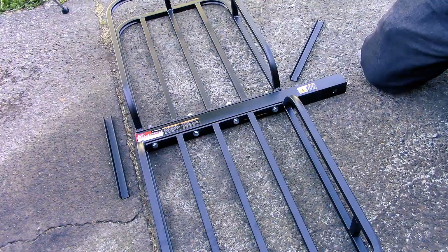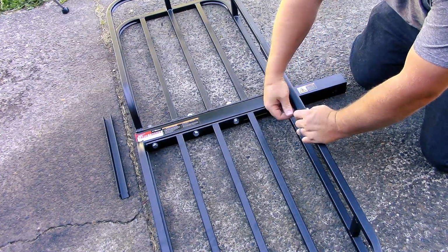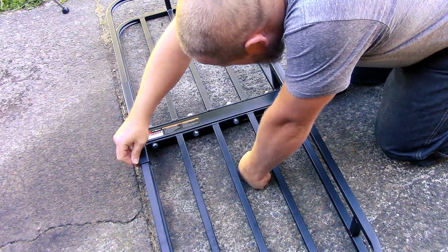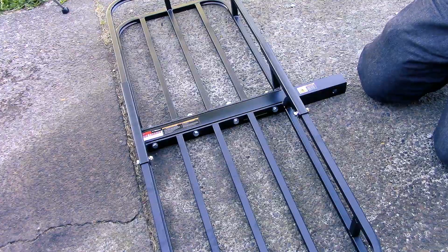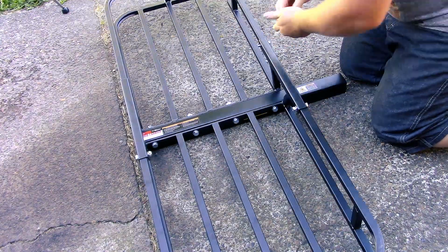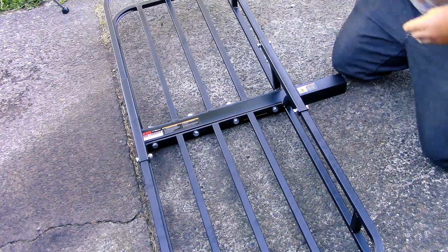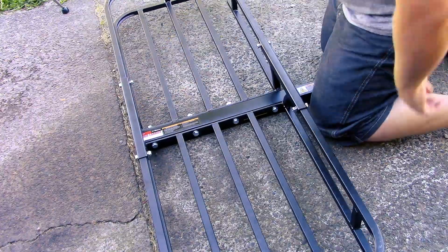Get the other 3 large bolts into their respective holes in the same assembly order as the first. Once those are all in, grab the 2 crossbar sections and set them in place on top of the 2 sections of platform as shown. Take one of the small flat washers and place it on one of the small bolts, then slide it from outside of the crossbar through the platform piece and through the other side of the crossbar. Place another small flat washer on the end, and finally one of the small lock nuts. Do that for the 3 remaining holes as well.